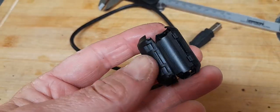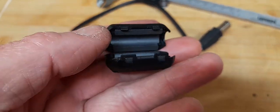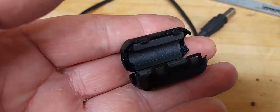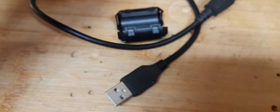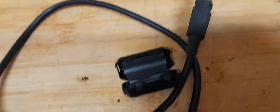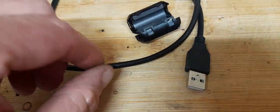You can also buy ferrite chokes on Amazon in different sizes. These are a ferrite choke — composite, like graphite — and they block out signal and sound interference, ground lift hum. You fit them to your cable. Make sure your cable and your chokes are sized appropriately; I've got a 4mm cable so I'm going to need a choke that's tight and fits onto that.